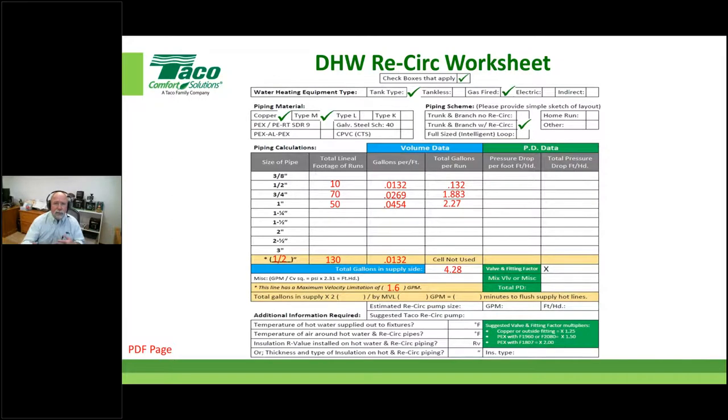Yeah, that's roughly a half a cup of water. About 10 feet of pipe is roughly half a cup of water. It's actually 1 cup or 2 cups, 5 foot or 10 foot. But again, that goes really fast depending on the pressure and everything. So understand that about the design. I'm not sure they're taking it right to the angle stop, but to the fixture is actually a pretty good way of getting this job done correctly. Very good. All right, continue.